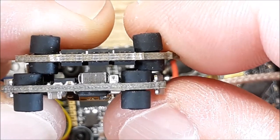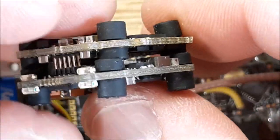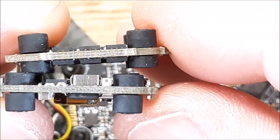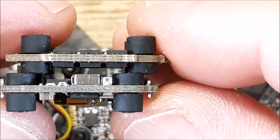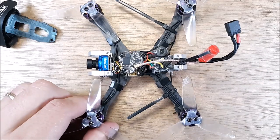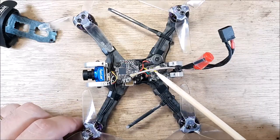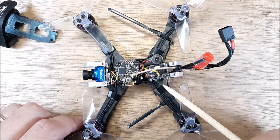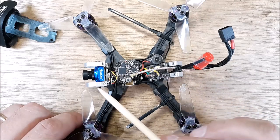Yeah. Keep an eye on that. So if you have, like, your quad keeps drifting and you keep having issues, then maybe you're either really tight or you've lost some stuff and your flight controller it's not square. So keep that in mind. So hopefully that kind of going through everything gives you an idea what I've done as far as wiring this thing up, in case you're having some issues, you just can't get something to work. That's how I've wired it. That's how I got it to work.